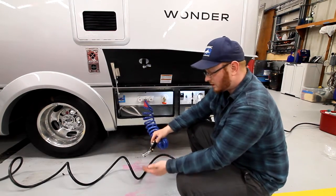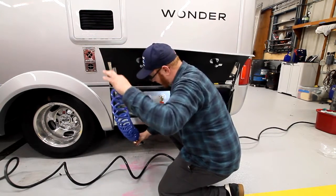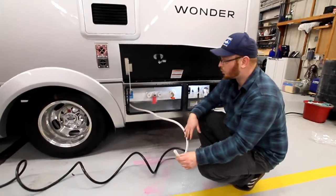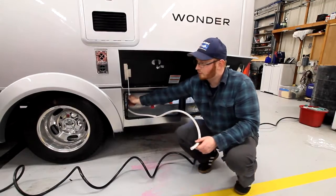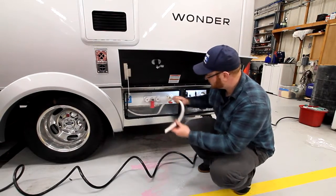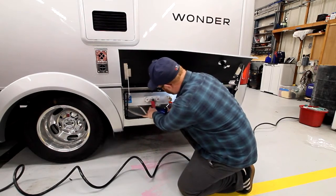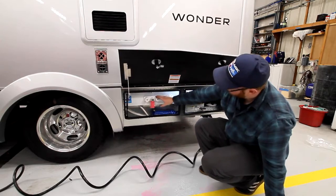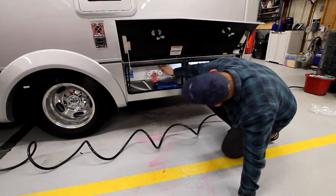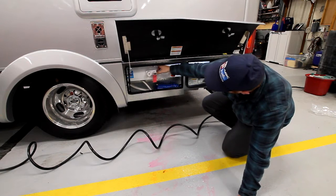We have cold and hot water — the hot's going to be from the water heater, and cold is just going to be from the source. To remove the hose, make sure you depress on this, releasing any water that's in it, push back on the collar and remove. There is a single hose inside — this is for winterization only. If you put this blue valve and point it to winterize, turn on the water pump and it'll suck from that source. Put it back to normal flow and that's going to take water from our fresh tank and put it to our city connections. To fill the fresh tank, above this faucet there is a silver valve — if you take this and put it sideways, that's going to take water from our city connection and put it to our fresh tank. Then remember to put this valve up and down to put it back to normal city water.